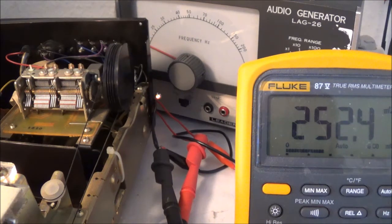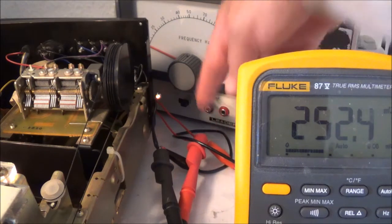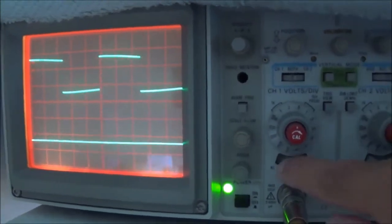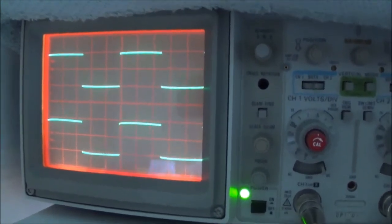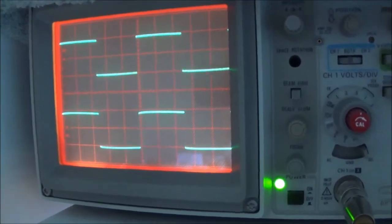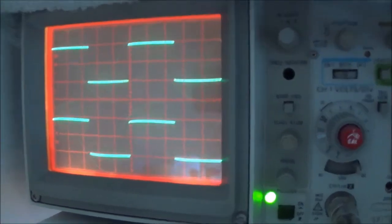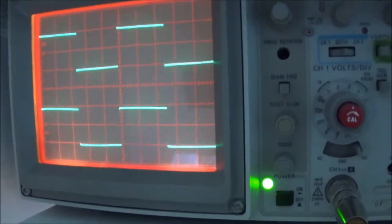I'm already set up with the generator at 200Hz in square wave position. Looking at the waveform now — there's a tilt while we're still in the AC position. I should note that your tone controls and loudness control have to be off, and tone controls set flat. Here's what happens when you turn the loudness control on — yikes — and here I'm messing with the bass control.